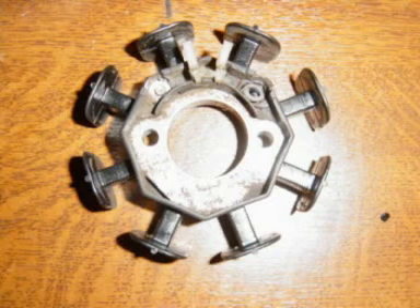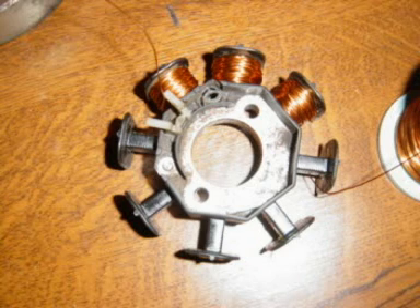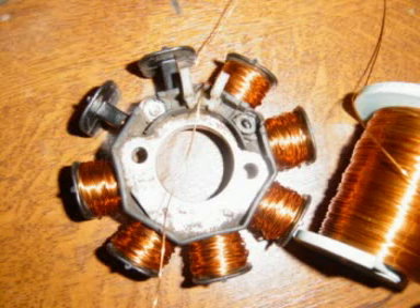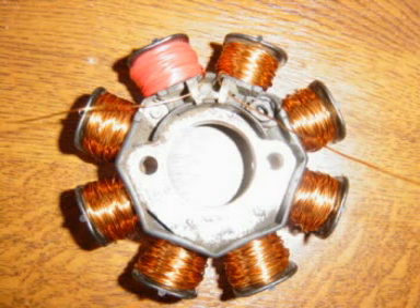When it's down to its bare insulated frame, we can start using the thinner wire. We need to put more turns on because the machine is going to be running slower, so we put about 300 turns on each pole. Then we complete the assembly.